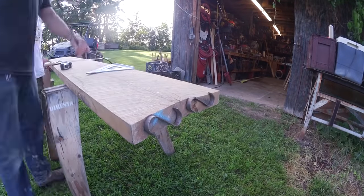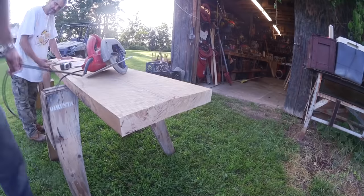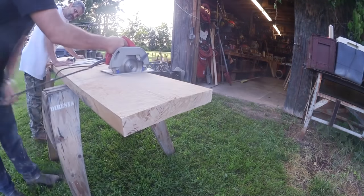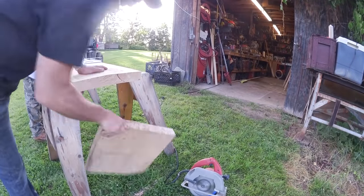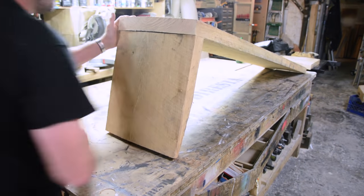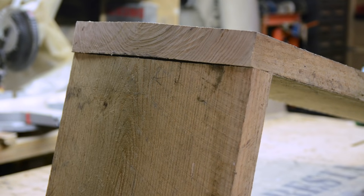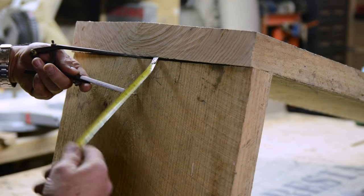This was the end of the day — Willie, my assistant in this video — we were getting ready to leave upstate and I knew I needed to bring this to the city. I get it in the truck, cut off two legs at 18 inches. I basically used almost the entire piece of wood except for those split ends with the S-hooks in them. Those S-hooks are to keep the wood from checking or drying and cracking.